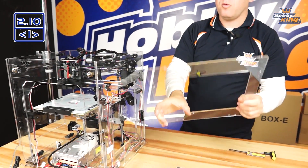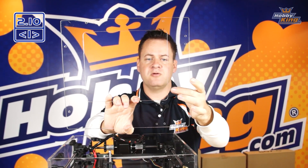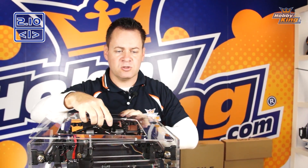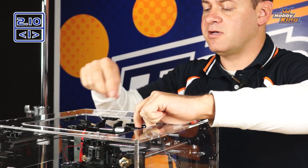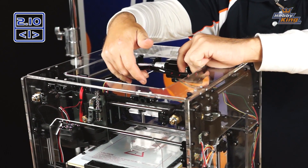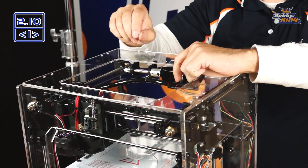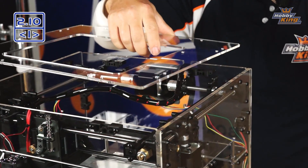On this cover, we need to be aware of one little hole that's right here. This upper cover just comes right on down to the printer itself and it bolts right on down there. But if you take a look around the outside, you're going to notice the one individual hole. If I just loosely put this on there, what that's for is for a zip tie to secure this on up. And that creates that little Z bend as this moves around and holds this loom up and out of the way as it actuates and moves around so we don't bind up. So we just need to make sure that this hole ends up on the left side — your right side if you're looking at it — and not the other way.